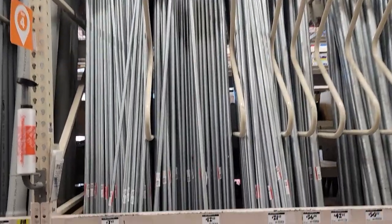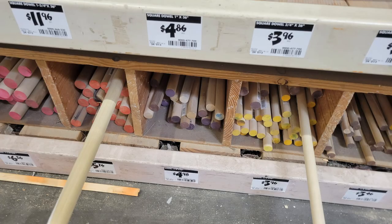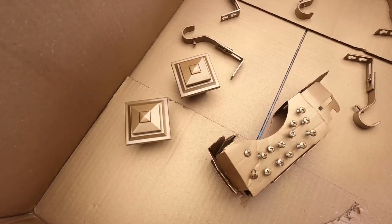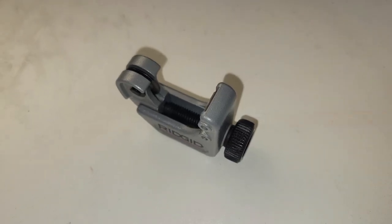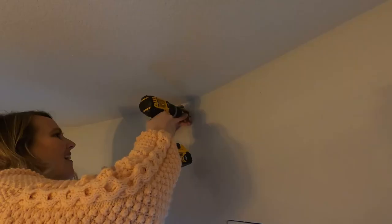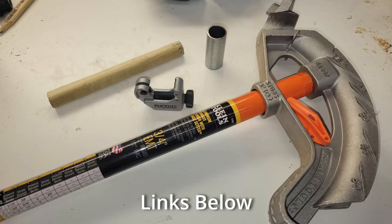Let's first start with supplies. We bought a couple of lengths of 3/4 inch conduit, which is metal pipe that's generally used for electrical work. We also got some wooden dowels, six curtain rod brackets, two finials, and a couple of tools. We used a tubing and conduit cutter and a conduit bender. A couple of other things that came in handy were a metal file for cleaning up the edges of the pipe, a sander for sanding down the dowels, and a drill for installing the brackets and finials. I'll also leave a few links in the description for all the tools we used in case you want to check them out.